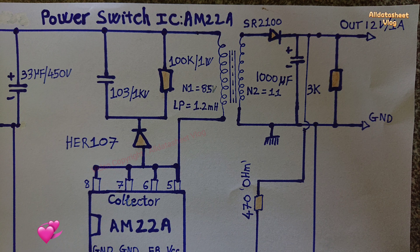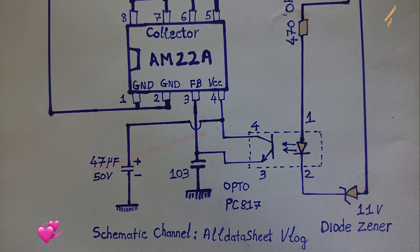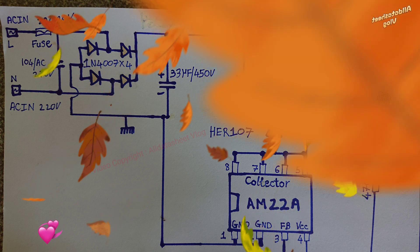Features. 1. Dual-chip design: high-voltage switch-to-bipolar transistor design to reduce product cost. The control circuit uses large-scale MOS digital circuit design with a drive bipolar transistor chip to improve the safe voltage value of the high-voltage switch. Built-in self-powered circuit — no external power supply to the chip — effectively reducing the number of external components and cost.